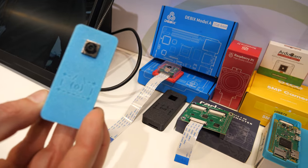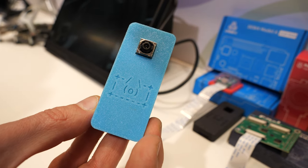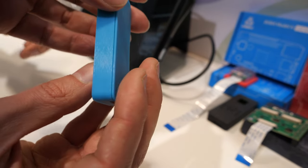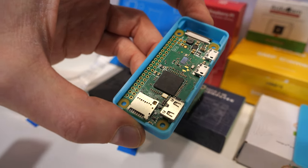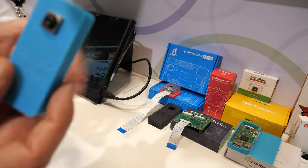This is a Raspberry Pi Zero behind the hood, with a camera sensor from Raspberry Pi — the latest camera module. It's actually used as a USB webcam. It runs Linux inside with full open source support. You run Linux on it, you run libcamera on it, connect it via USB to your computer, and it's recognized as a webcam.